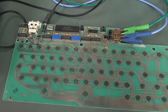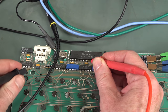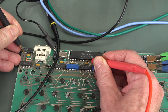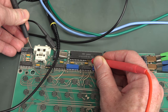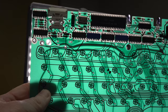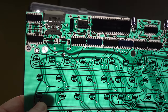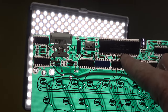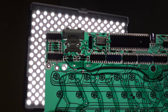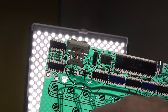I'm going to trace that 400 kilohertz signal and see where it goes. Of course, it went to the very last chip I scanned — because you go around and scan all the pins like this. Finally I got across there — bingo, last one. Bloody Murphy. And here's where your studio lights come in handy — you can see right through the board. I couldn't actually trace that 400 kilohertz signal out of there. It went up somewhere and I can't see where this pin goes because it's on the top side — it buggers off under there somewhere.